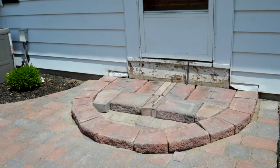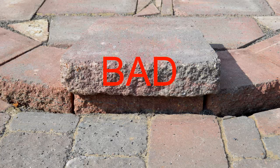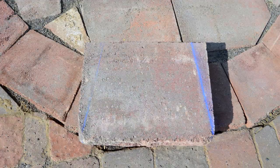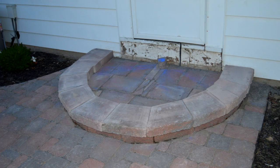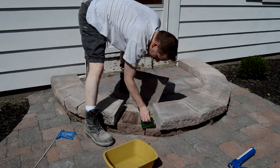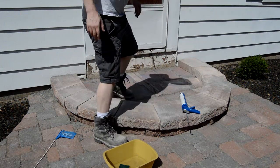For the inside of the base, I filled it with whatever fit, and then filled the gaps with tiny stone mix salvaged from the old step. For the cap stones, the miter saw wouldn't cut far enough, so I got a new blade and switched to the circular saw. To avoid having alignment between the caps and the base, I set up the first cap to split the step in half. I used a chalk line from the center of the door to get angles that would point to the middle of the step. That, and aligning with freshly cut neighbor caps, assured the geometry would fit together pleasingly. After those were laid out, I cleaned up the inside edge. The next morning was glue time — wash off any dust from the bricks that might interfere with the adhesive, and be sure to use the landscaping glue made for stonework. Have fun making absolutely sure that things are mashed together nicely.